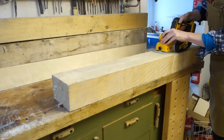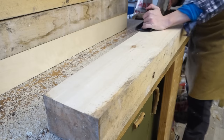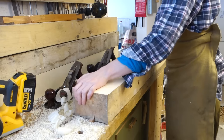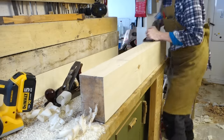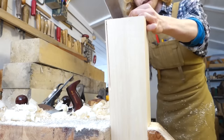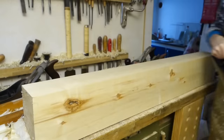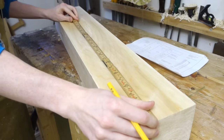This is birch, and finding these solid 90 by 145 millimeter chunks was actually the starting point of this new bench idea. As always, it begins with flattening a face and squaring an edge, then bringing the opposite face and edge into parallel. I chose to spend some extra time sawing away the material here instead of planing, as I thought this would make a quite nice thick veneer for some other project. Then I sawed the legs to length and picked one to lay out the cuts for the leg vise on.